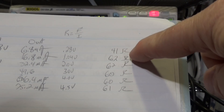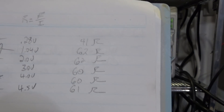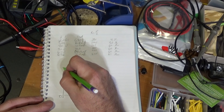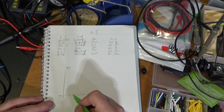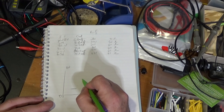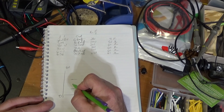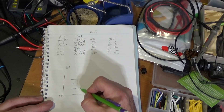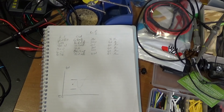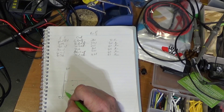Looking at these different voltage levels, if we throw away the low one where it was barely turned on, the equivalent resistance is about 60 ohms more or less. That does not look like a constant current source. We see this laser come on somewhere around two volts, then three, four, five — and it looks like it's probably linear up to five volts. So what we really want to do is run this at about 3.5 volts, so the waveform won't drop down to where the laser cuts off or go up to where it gets even more non-linear.